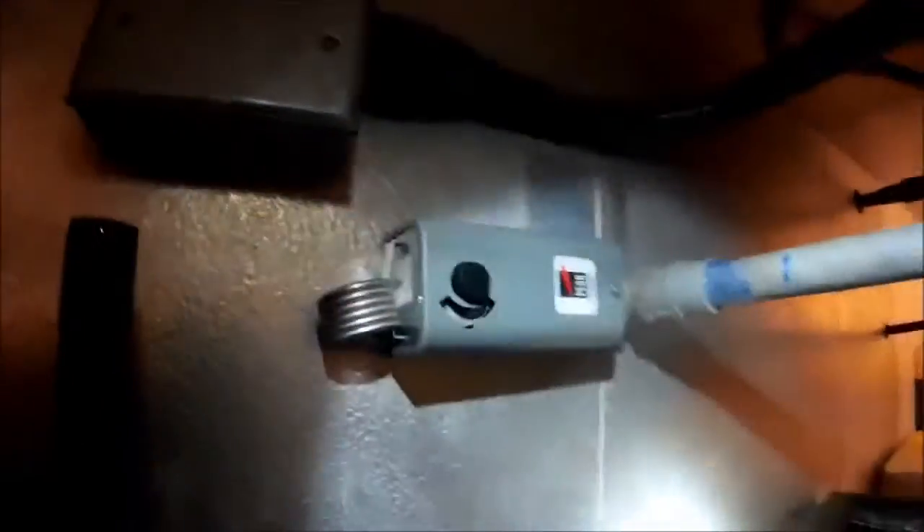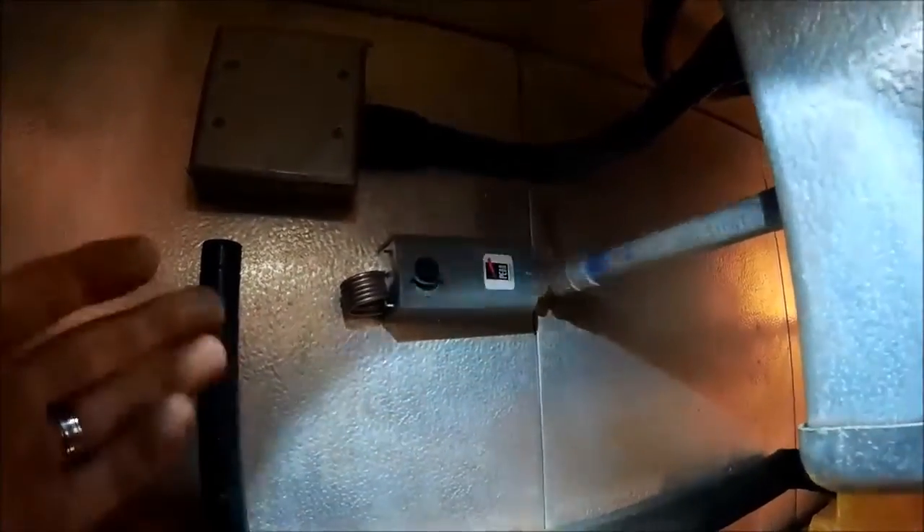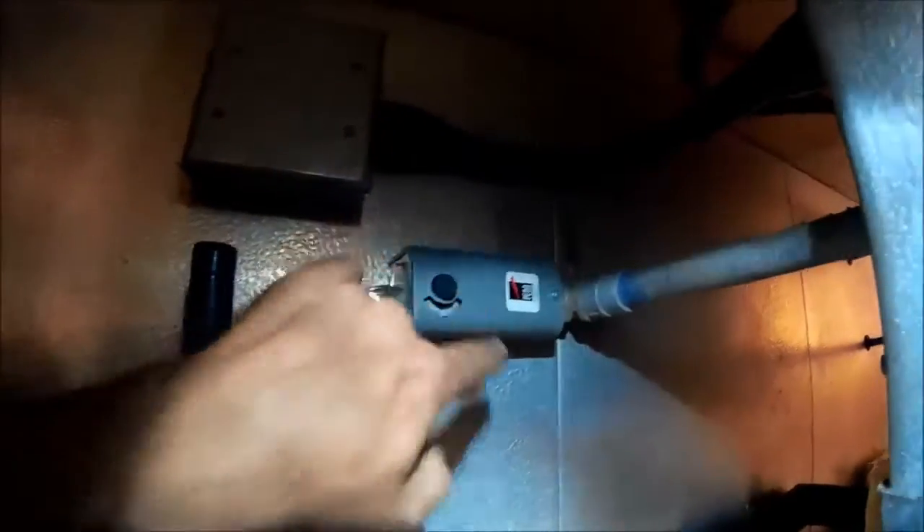I did get another control really quick — luckily, I just made it there by 5 o'clock. We got the new control in. This walk-in cooler has been a disaster: it's been the capacitors, it's been the time clock, and this thermostat failed while I was here. I was having problems the other day — it seemed like it had a huge differential, and I thought the capacitors were bad, which they were. But the reason it was running warm is because this thermostat wasn't working — probably a combination of everything.